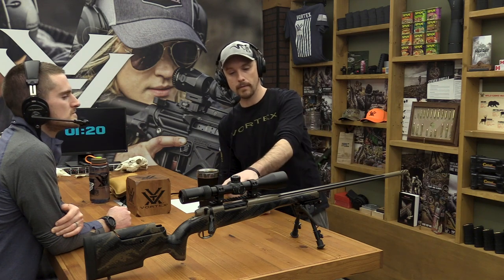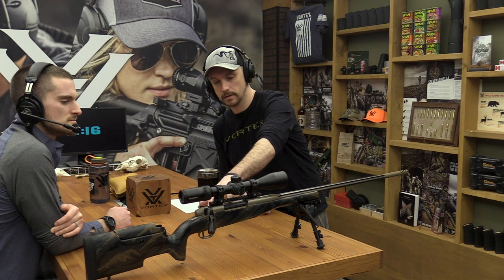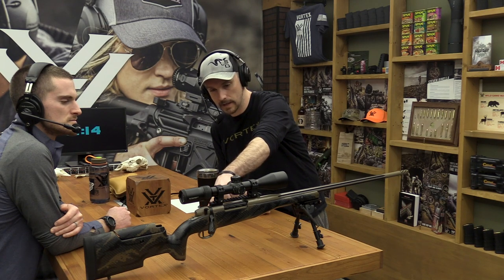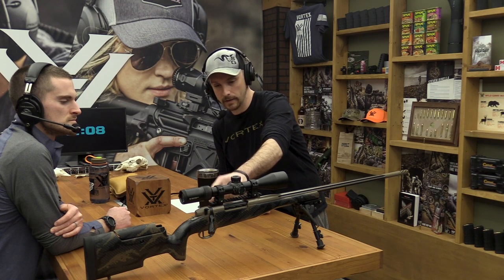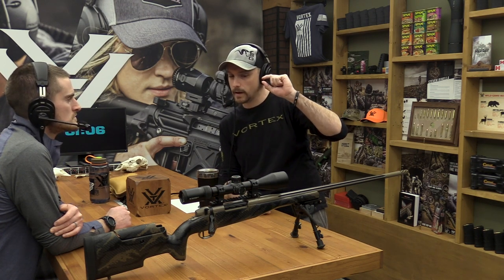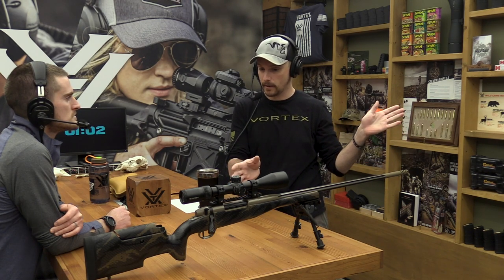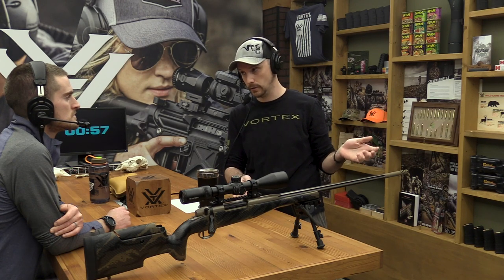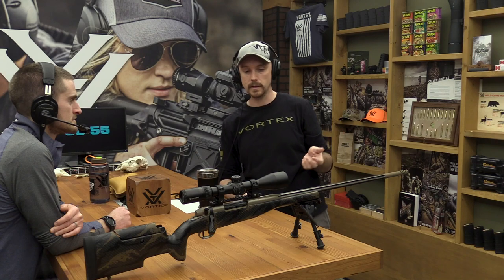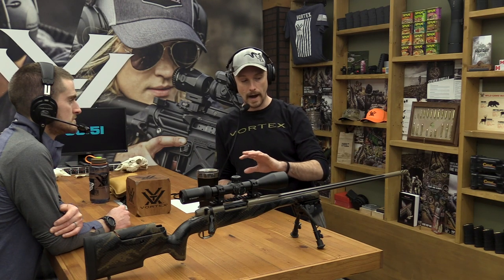We've seen it too, not super common, but the makeup of the rifle itself, looking at the receiver and where the islands of the base are, or where the base is attached. If there's an unintended discrepancy in the spec on, let's say, the rear island, like if it's lower than it should be by even an infinitesimal amount, and you end up with what we'd call a misalignment in the rifle, sometimes a 20 MOA base can correct that too.